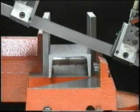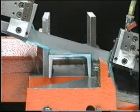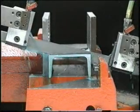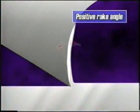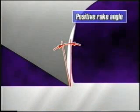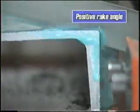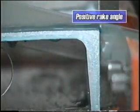The DUOS blades incorporate many more functions that make possible efficient cutting work. By providing a positive rake angle at the tips of the teeth, the bite of the blade into the workpiece is improved. And the blade does not lose its sharpness even under severe cutting conditions.